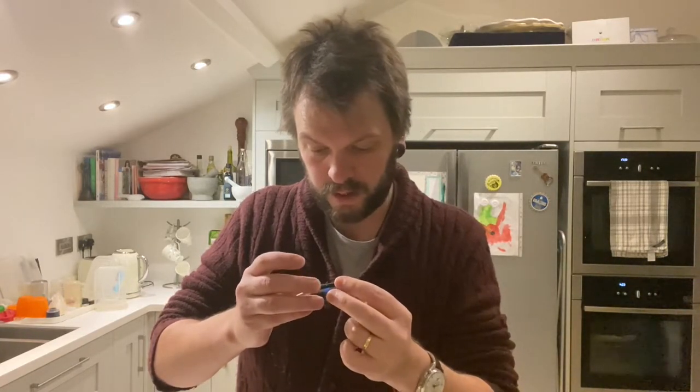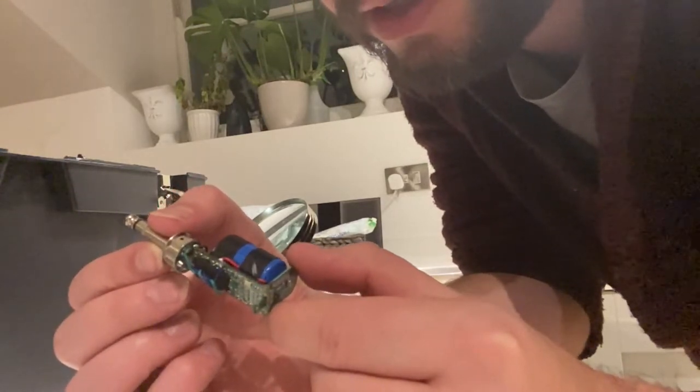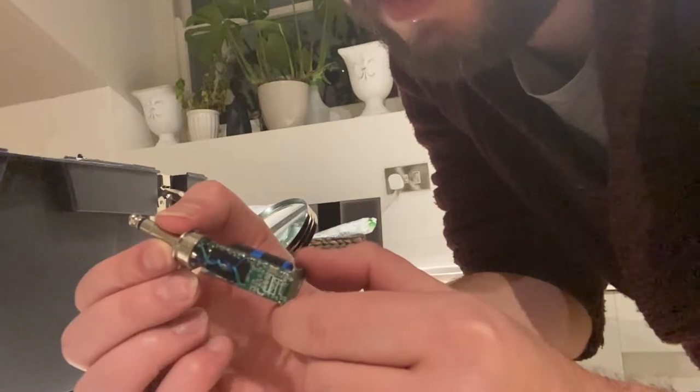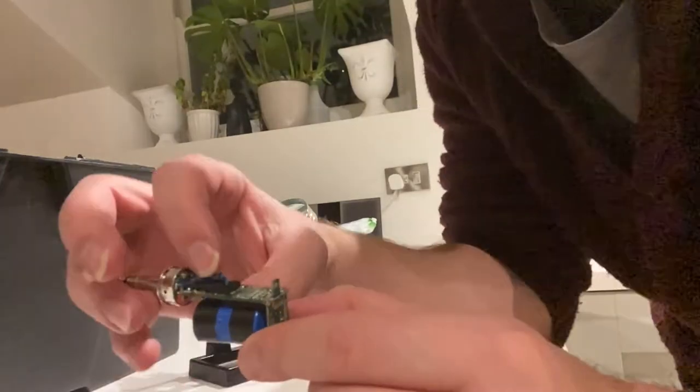I'm going to see if I can fix it and thought you could come along for the ride. To open it up there's already a tutorial online, but I had to buy these Torx bits. It requires a T6 and a T5 to open it - for no apparent reason there are only two screws and they're different sizes, so go Line 6. Coming down from the top there is a green wire and a blue wire, and the green wire is not attached - it should join just here.